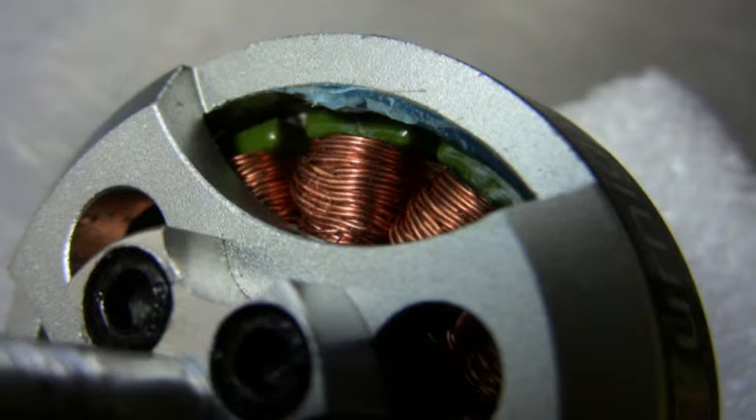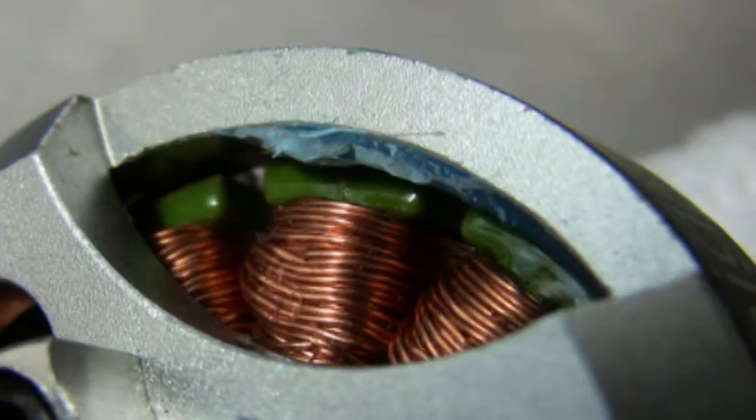Here are some close-up photographs I took on day one of the inspection — more or less what I saw from the outside. Do you see that blue streak between the copper coil end cap and the outer rim of the magnet mount? It doesn't look like much. I've been attacking it with a knife — the paler blue colourings are where the knife has hit it, the darker sections are where it hasn't scraped yet. It's pretty tough stuff. If you go online and look at sample photographs from both major worldwide distributors for Turnigy Motors, you'll see exactly the same blue tinge on the top frame of brand new motors straight from the factory. I think there might be thousands of motors in circulation with this fairly minor problem.